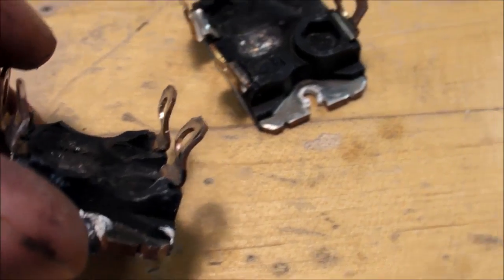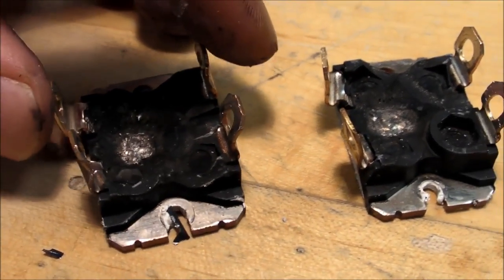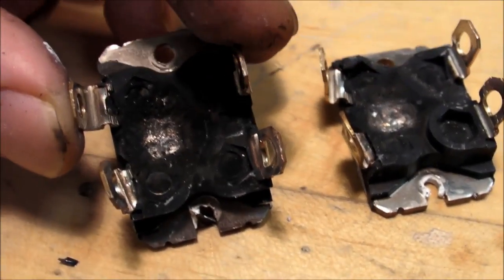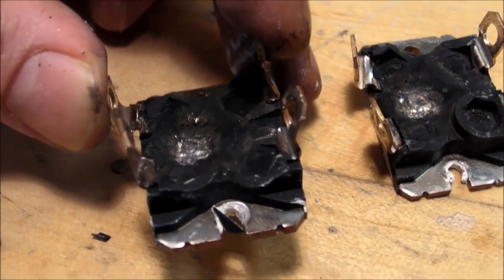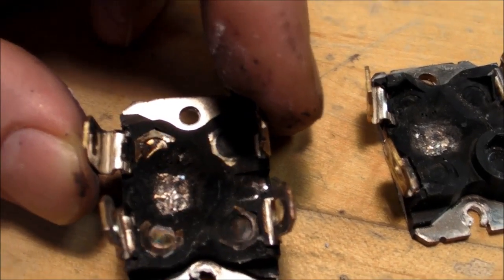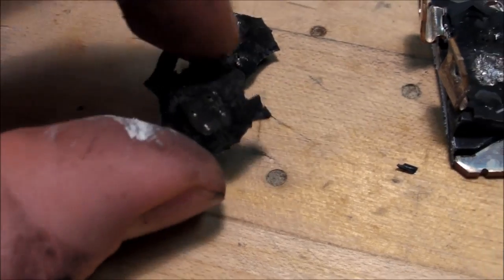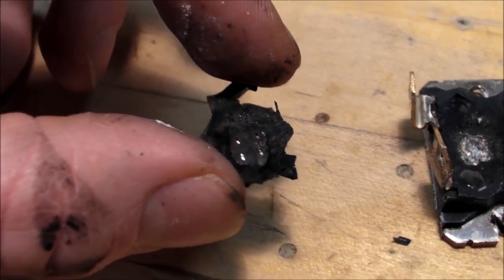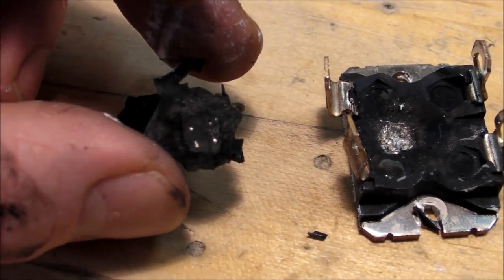Each one of them is blown up on one side. The actual silicon die is apparently not mounted in the center — it's offset a little bit. This is the gate and the drain, and then two sources on the other side. It's just a little cavity, a crater, with tiny little bits of molten metal in there. You can see four little indentations that correspond to the other side of the plastic — four holes. I think those are the bond wires. Basically it's just total meltdown.